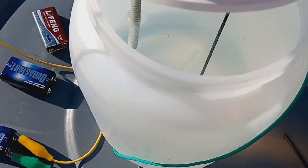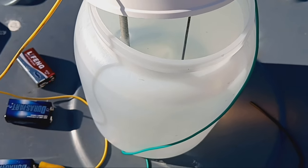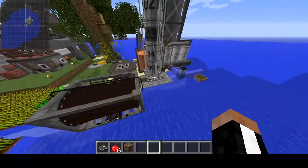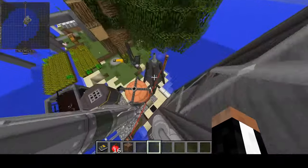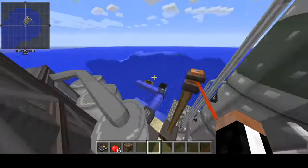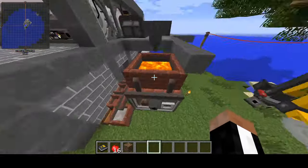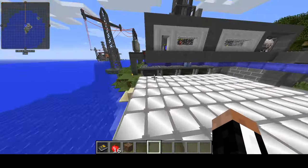Usually when I do one of these chemical processes I end up with a final product in the video — today we won't have that, just a heads up. Graphite is a poor anode material because it will be destroyed by the chlorate. Steel or iron is the only cathode material we can use, and it is damaged by the hydrogen that comes out. Our main goal is to keep the pH below 7 and, if possible, increase the temperature beyond 40°C — which in this case is not possible.